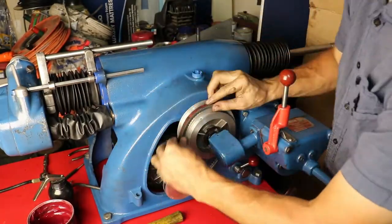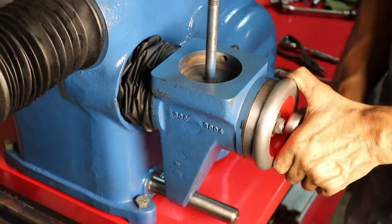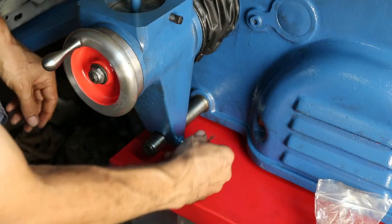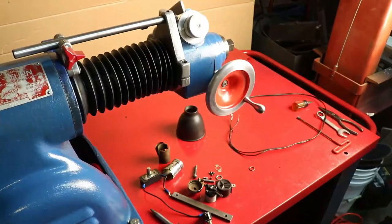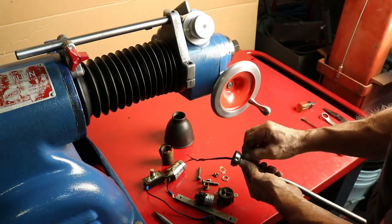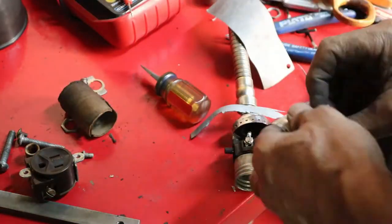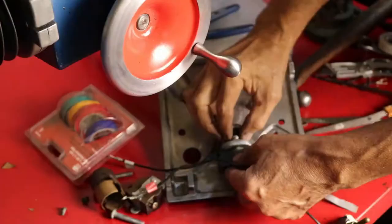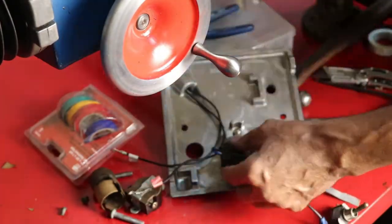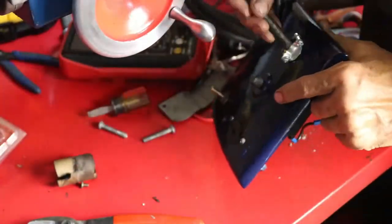Finally, the cross-feed crank is installed and the knob is done. The electrical panel assembly — first, cleaning and inspecting the lamp, wires, receptacle, and light bulb socket. Everything seems to be good except for the paper insulator, which I will replace with fish paper insulation. After installing new connectors, you have to be careful to identify which wire is the neutral and attach it to the socket threaded part, and the line to the center of the socket. Replacing the main power cord and properly grounding the lathe is a must. Follow the electrical diagram or schematic.